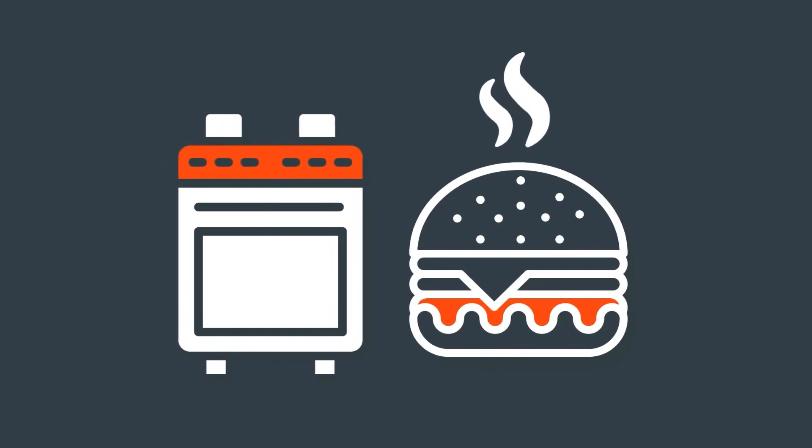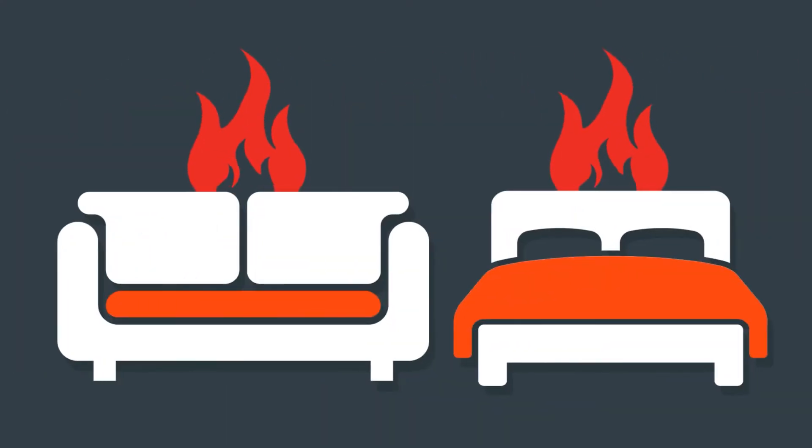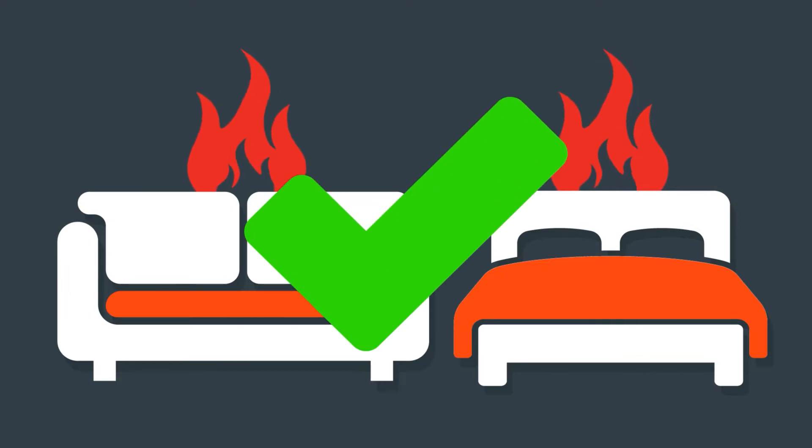Jeff Cutler, Head of Systems. The UL standard changed because research showed that the fires which it was weak in detecting with the current standard were polyurethane foam from new materials. Also they had a need for false alarm reduction, so they included false alarm fires inside the new UL fire test.